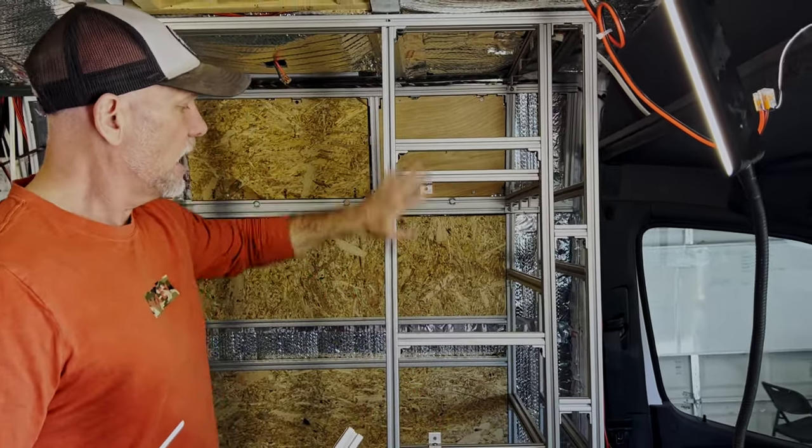You'll notice these lines that we drew — these lines are where our tile ends. And you'll notice this slight gap, which is the thickness of the tile we're using. So just by way of example, if we put this last piece in here nice and secure, and then we take a piece of the tile and slide it up against this wall, you'll notice it's perfectly in line with this black guideline. On this wall the tiles will end right here, right up against this one. You'll know you're all set — you'll have a really tight fit here. And then this will have waterproof corner beading all throughout the seams and the corners, silicone, and you should have a completely watertight shower.